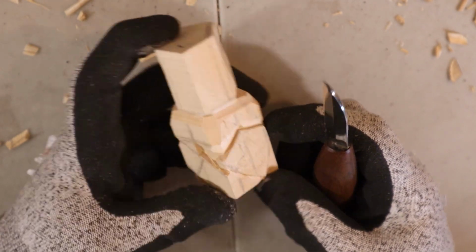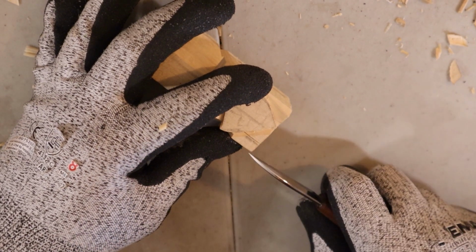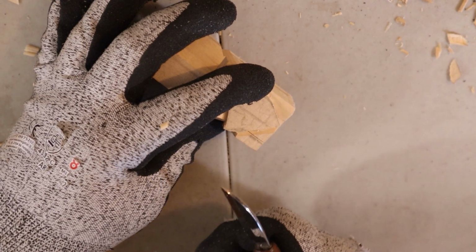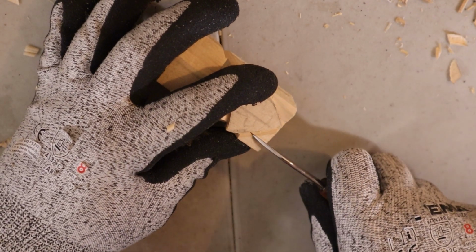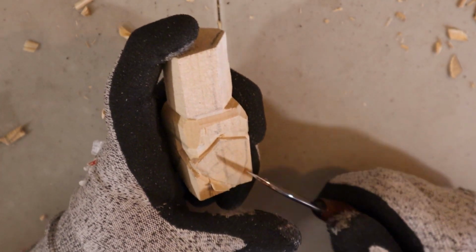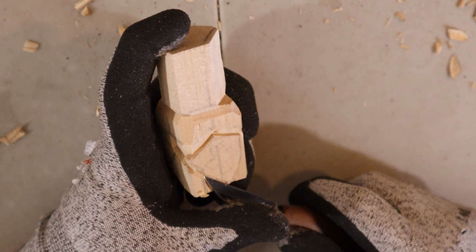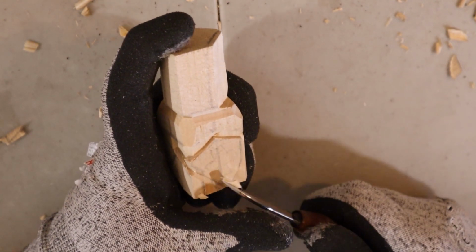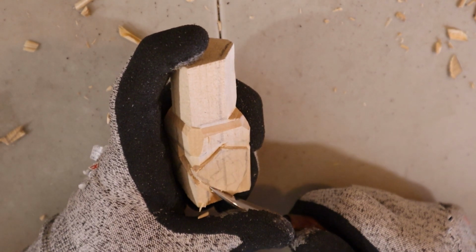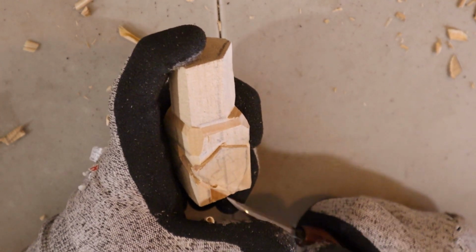Of the front here. Okay, now we will do the sword part there. So a little stab. Be careful because you have the end grain here. So you don't want to push too hard so this whole sword will break out. Just want a little cut to help you. Okay. Then from here slowly you will remove wood. Make sure that the tip of your knife is following the line and all the way here under the shield and in the little corner. Slowly by slowly, you don't have to try to remove a giant chunk of wood. Okay. Like so.